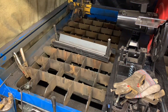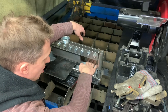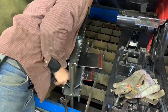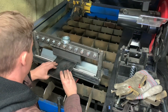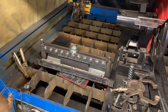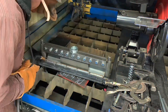One thing I think is important that I haven't seen anybody make mention of when it comes to setting up the lower die here is it being parallel across this flat surface as it is to the bottom surface. That way you're not starting your bend at a bad angle. You know that if you put a digital angle finder on there that you're starting off at as near zero as possible. What I would recommend is I've got a plate underneath here that spans both sides. I'm just going to measure top down on both sides, make sure it's as close as possible, go and tack that in, and check it one other time after that. That way I am a little bit more confident that I'm starting off with a flat plane.